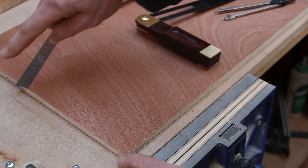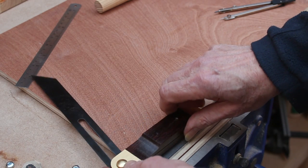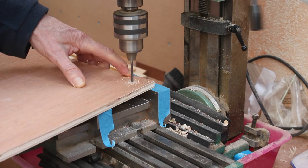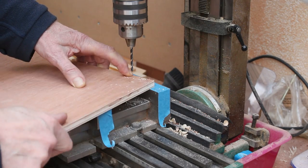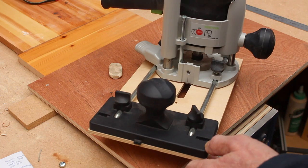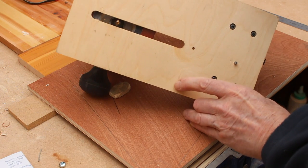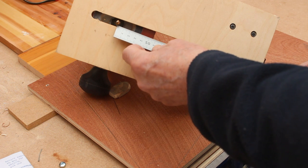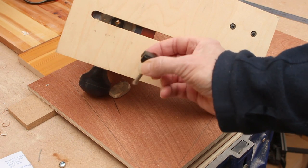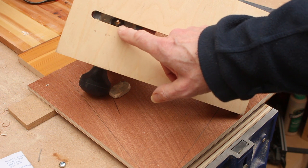I think 90 degrees of adjustment is excessive — I won't want anywhere near that much. So I've set this to 15 degrees off each side. I've put the router in the circle cutting jig and set the distance from the pivot to the cutter to 19 centimetres. I've put a quarter-inch cutter in — the star knob for the adjustment lock has a 6mm bolt on it, and a quarter inch is 6.35mm, which gives a nice clearance in the slot.